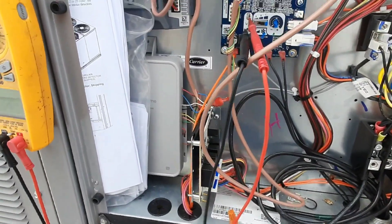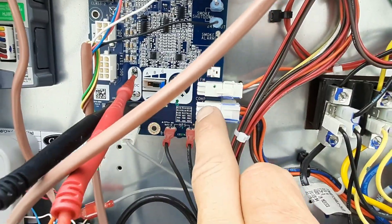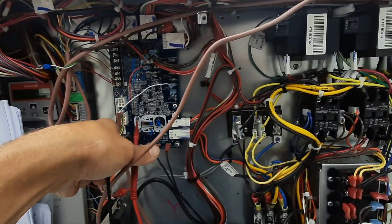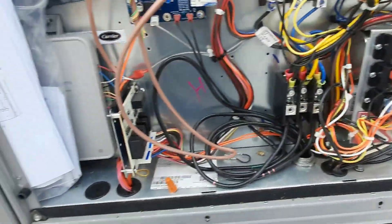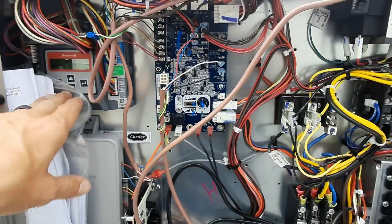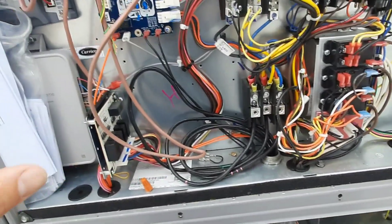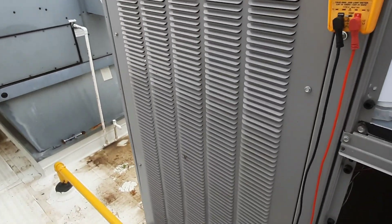It's not a bad little spot here. I haven't made any adjustments — they've got this thing ramped all the way up pretty high. You can see the potentiometer's turned up and we're on setting C, and I've got 9.5 volts. We did not install this — I'm not sure who did. I need to figure some things out; we probably need to go back through the setup. It all seems to be wired correctly. You can put the jade into just a single speed fan, but they've got it ramped all the way up regardless. We probably need to go through and check static and everything else. We've got a whole lot more work to do — this thing's been running and it hadn't cycled off for me in a while. We're gonna have to clean coils and all that good stuff. We're gonna have to talk to the customer about this.